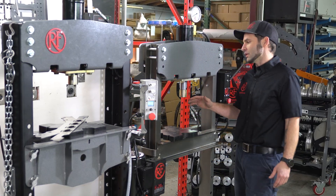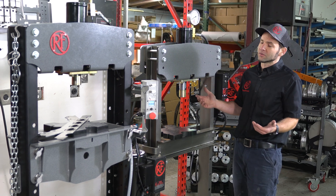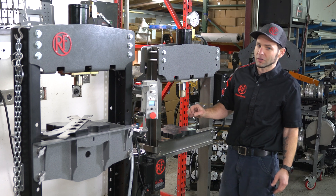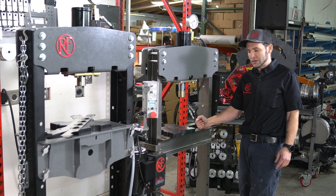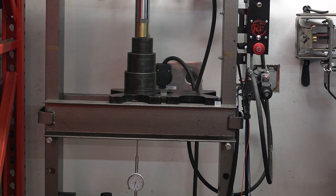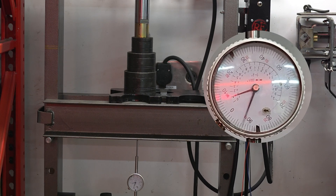In contrast, the Harbor Freight 20-ton press was not aimed at the same market, so it's not really apples to apples — but we did do a controlled test using the exact same power unit producing the exact same pressure, the same cylinder, and the same top for an accurate table comparison. The dials shown on screen are 100 thousandths per revolution. The Harbor Freight table's deflection is substantially higher, and will result in parts that do not assemble the same as parts done on a VersaPress.